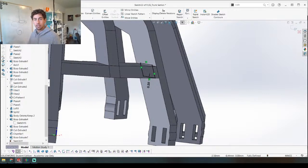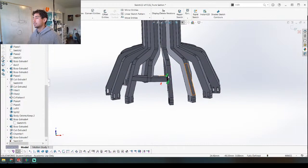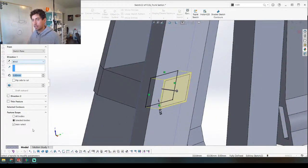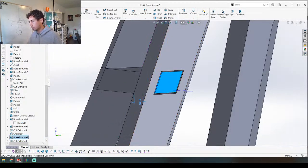All right, did that fix the mic clicking problem? Yes, the problem is fixed — the old unplug and replug. So let's finish what we're doing here — we're just going to cut this out and make sure we're cutting this piece right now. There it is right there, and I think I want to make this a little bit smaller, so I'll just increase this dimension — boom, and that should work. So the process here for putting this together: I'm going to take this slot into this guy, these are going to slot down into the base, and then I'm going to put this guy in and then put the top cap in. That should hold everything in place.